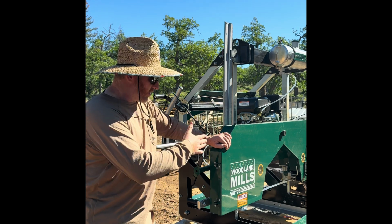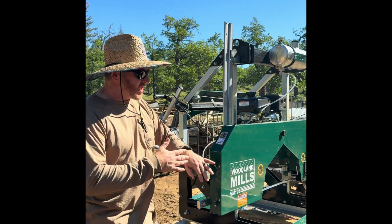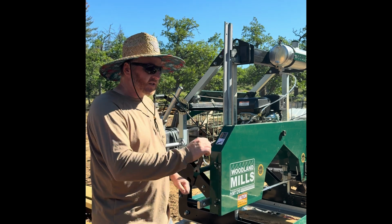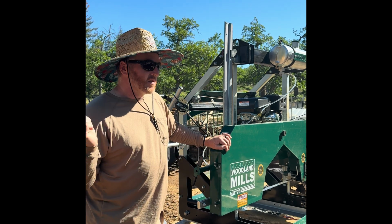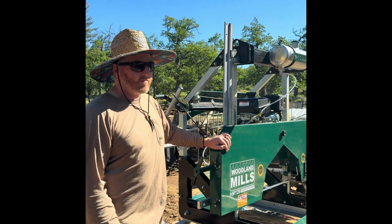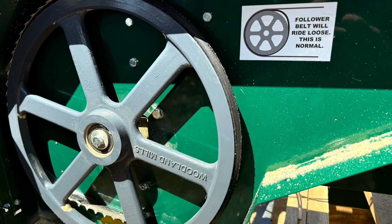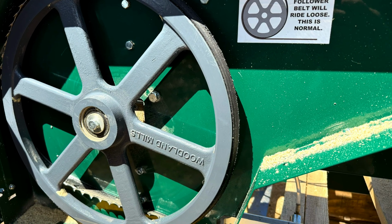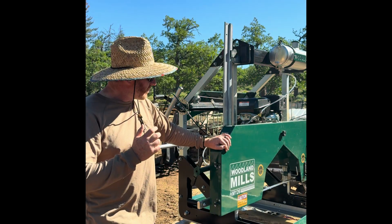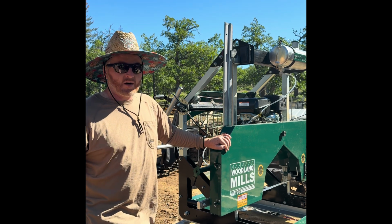And so now I'm like, okay, something is wrong. Check pulley alignment, tracking, all this kind of stuff. Everything is spot on. Went through the adjustment procedure 3 times. Okay, everything's good. Click, click, retorque. As I spin up, everything's going fine, but then I let off the throttle, bam! And it actually wrapped the blade up into the pulley that time. Completely tacoing that blade. So I'm like, okay, maybe I'm in over my head on this. What the hell is going on here?